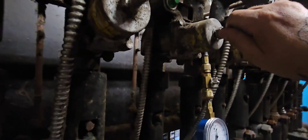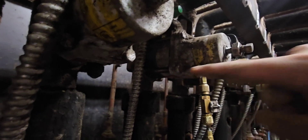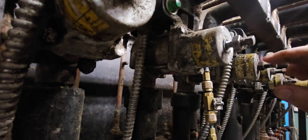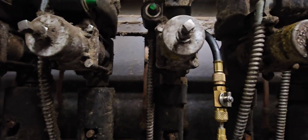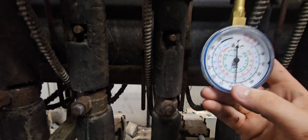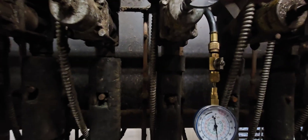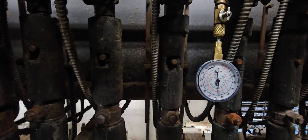All you're doing is twisting this bolt — the nut is just a locking nut. There's a diaphragm inside that you're basically pressing on as you open and close that bolt. The bolt puts pressure on and takes away pressure from that diaphragm, which lets more or less refrigerant through. Since pressure is directly related to temperature, I can see my pressure and know my evaporator temperature. I want to take this up to 70 psi, so I tighten the bolt — righty tighty — and it should adjust pretty quickly.